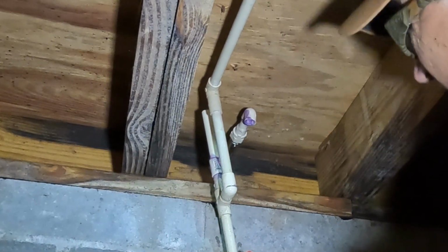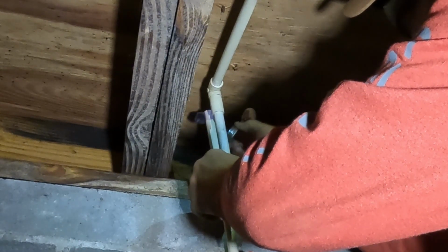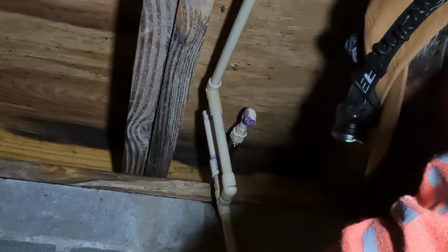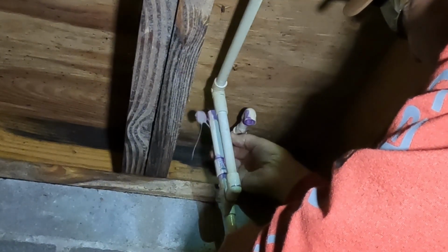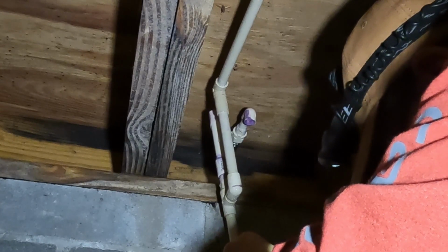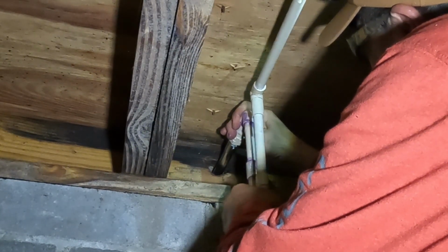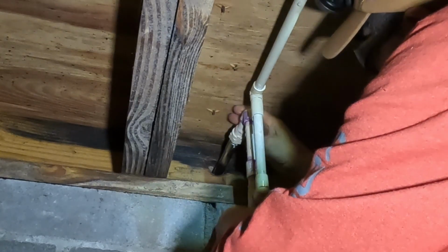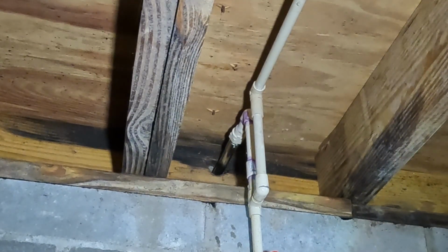the piece of pipe that I just installed now will have to go into the upper elbow, just making sure that I had enough space that was flexed out to be able to get this piece into the elbow. Putting on the purple pre-treatment for the pipe and then put the glue on, and fortunately, as you can see here, there was enough room to be able to get the pipe inserted and make the connection okay.